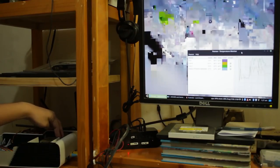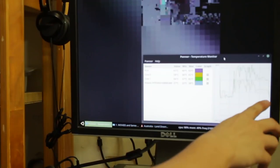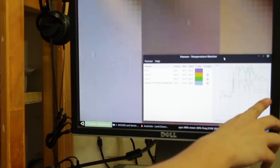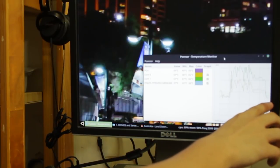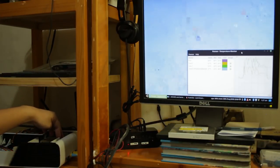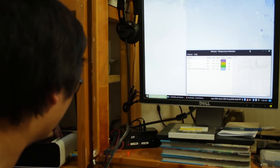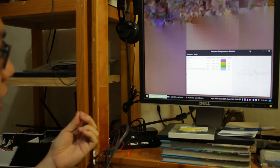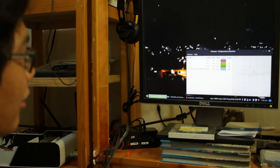Now, I hold the heatsink here on its right side. It plummeted. Temperature just plummeted even though the CPU is still pinned at 100%. I found the issue. The issue is that it is not tight on one of the sides. My hand is kind of painful now. And the temperature, yep, it has spiked to 80 degrees. Let's stop it now. On the next episode of FrankenPC, redo.